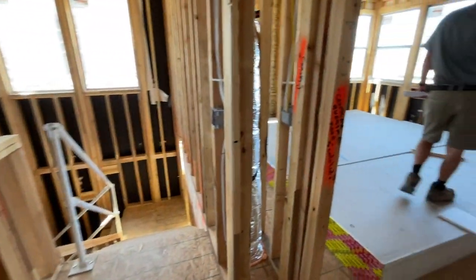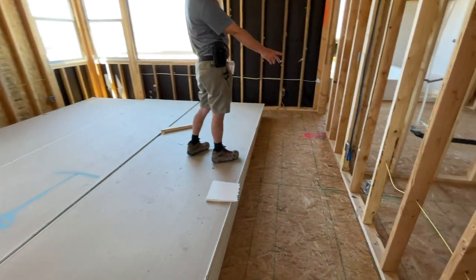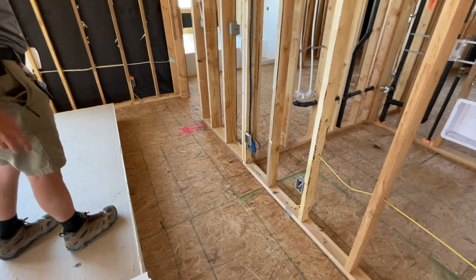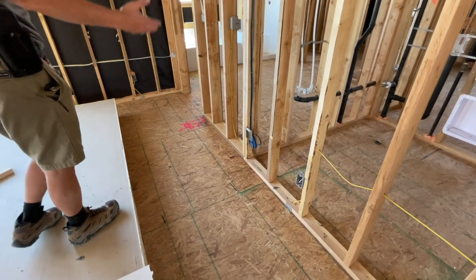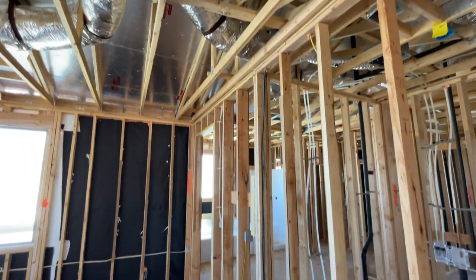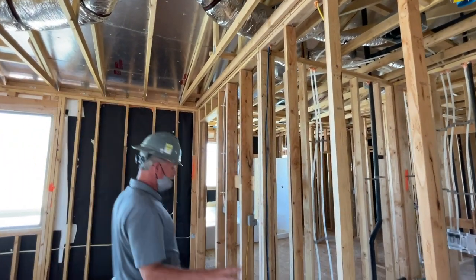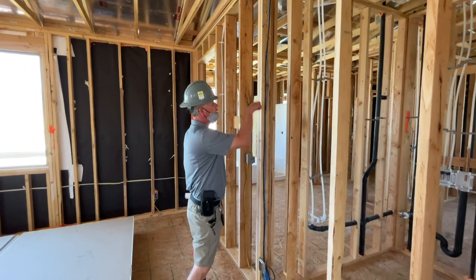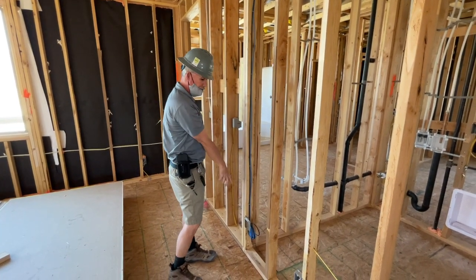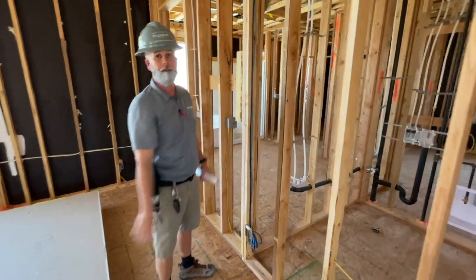There's also one here in the master that's down low. So again, you have the blue line, which is the upgrade of the old phone lines, which were Cat5. These are Cat6, and then you have the coax cable, which is the RG6 for cable TV. Just remember, this wall is non-bearing, so later, if you don't put furniture here, you can always just knock a little hole in the wall above the box and drop your cords down to plug it down low so you can bolt your TV up and not have to see the cords.